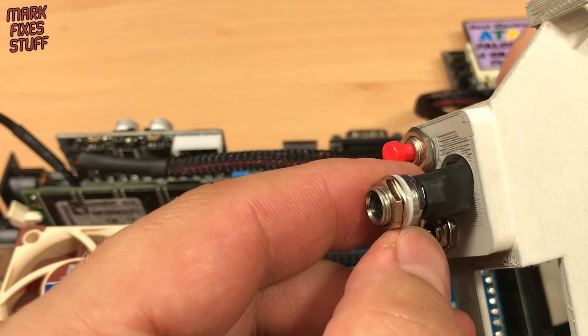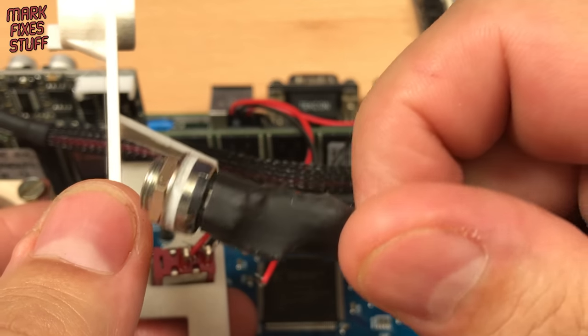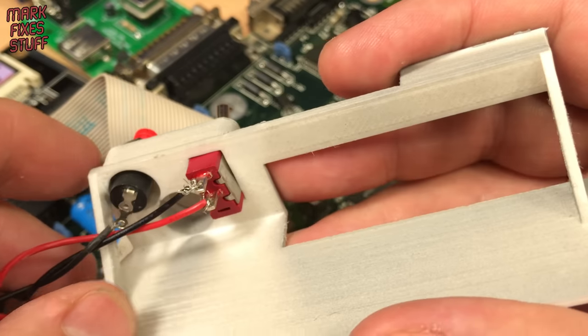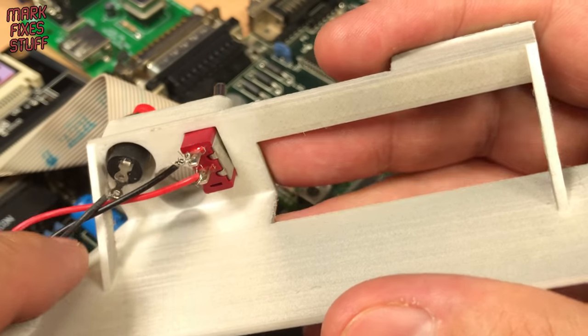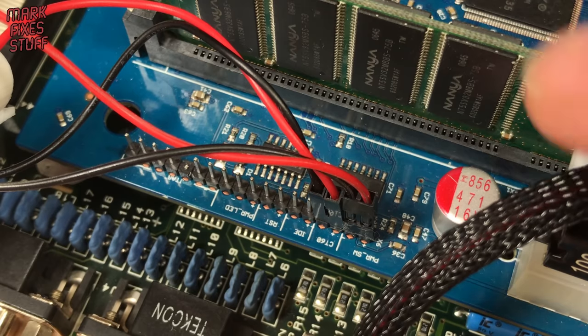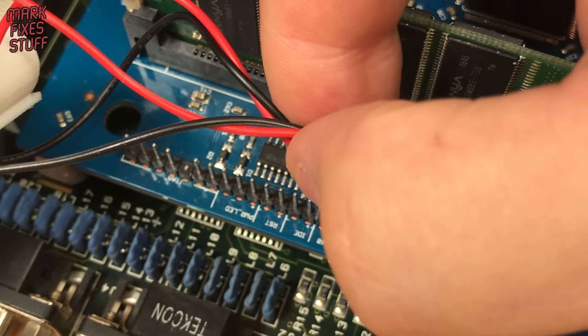So let's do the other repairs. The wiring is very flaky here. The power switch and CT60 toggle switch are simply twisted onto the terminals. At the other end are Dupont style headers. So we'll fix this and neaten them up as well.